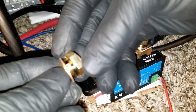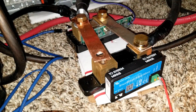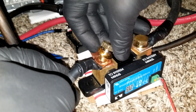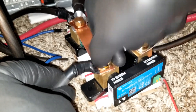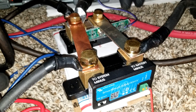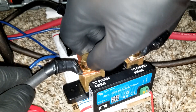The Victron has a heavy-duty bolt and this one's smaller, so I have to use two wrenches. We take this other shunt and put it up or down, whatever works. It looks like each charge controller is measuring the power from one shunt and the other one is doing the same — the Classic is on one and the other shunt is on the other. The bigger cable right here is the inverter.